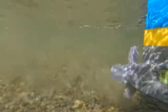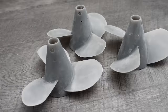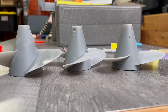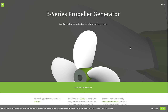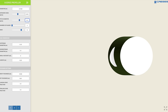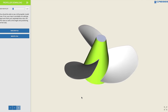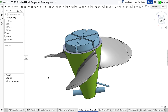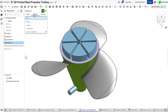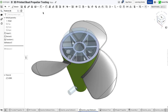For this next round of testing, I made three new propellers that each have the exact same 6-inch diameter as the toroidal propeller. Each one has a different pitch ratio, so we can find out which is optimal for the RPM and speed we'll be operating at. To make these propellers, I'm using a free online B-series prop generator — specifically the geometry tool. If you enter in a few settings, it spits out a nice clean B-series propeller. After that, I loaded the 3D model into Onshape and made a digital mold, which allowed me to quickly do a Boolean subtraction from each of the three B-series propeller designs.